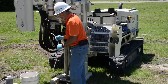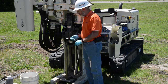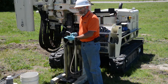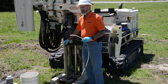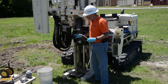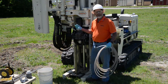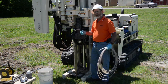The ScreenPoint 16 provides a quick way to get a groundwater sample — with about a two-foot length of screen open to the formation to purge from, it allows access to groundwater at various depths. You can also check the water level to determine the piezometric surface. Additionally, a pneumatic head can be attached to run a pneumatic slug test, enabling measurement of hydraulic conductivity over the screened interval. After sampling, the tubing check valve is removed, and the rod grip system pulls the tools out and recovers the screen. Before the next location, tools go through decontamination to prevent cross-contamination.